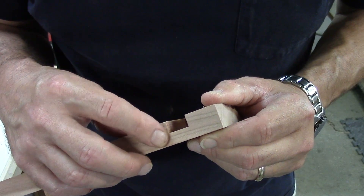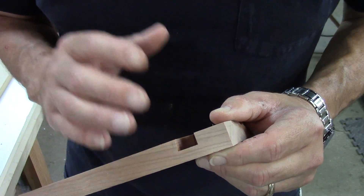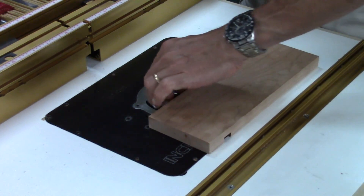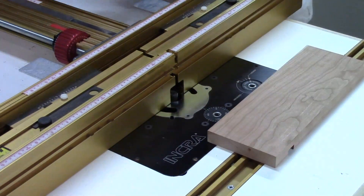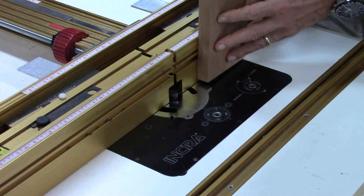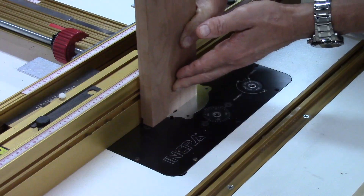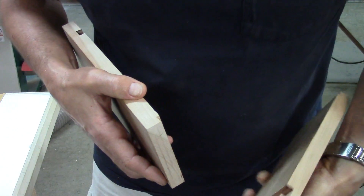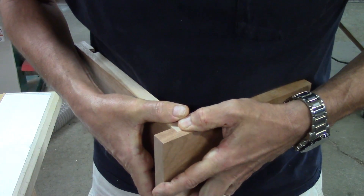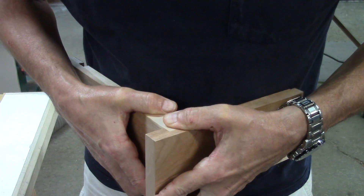The second pass was made on this edge, and as you can see there's just a slight angle — that's going to be more than enough when I create the mating piece to lock this all in place. The procedure to cut the mating piece is a lot like the last one: get where that bit is at the leading point, back it up almost a sixteenth of an inch. I just need to make sure I cut this only on one side. This one took about five passes to dial that in. Again, this is the fit I'm looking for — just hand pressure, without a hammer, to get it in there. A nice tight joint, a little bit of glue on the end when I assemble it, and this will stay nice and tight to the front.